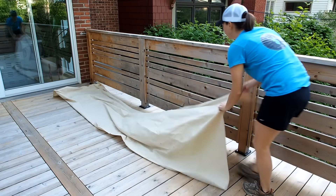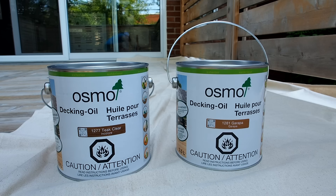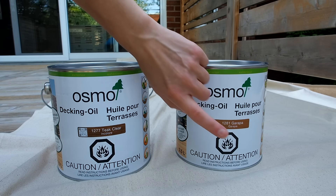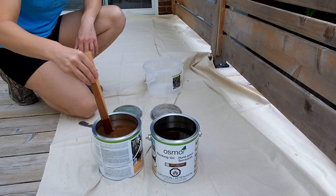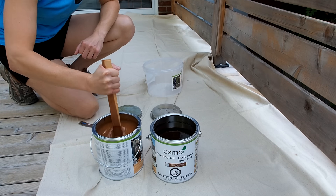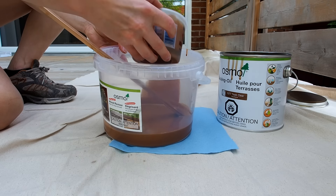To protect the deck I'm using Osmo's decking oil. It's weather and UV resistant and has a microporous finish that won't crack, peel, or flake over time. I chose a color called garappa, but I've also got some clear oil and I'm going to mix them together. The colored oil has UV protection but the clear oil doesn't. I personally prefer lighter colors but still want the UV protection, so Osmo recommended I create a 50-50 mix to get a slightly lighter color without sacrificing protection. It's really important to stir the oil well — all the pigments are usually at the bottom of the can, so you want to make sure to mix those in.